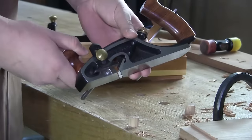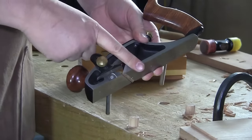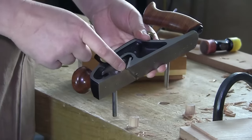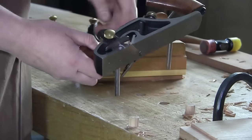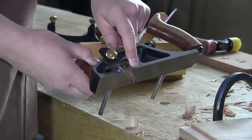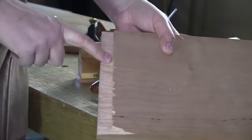In order for the blade to do that, the blade has to be proud of this surface. A 64th of an inch proud doesn't matter — it could be an eighth of an inch, a quarter of an inch proud of this surface, because it is the blade and the extreme point of the blade that is setting the shoulder of the rabbet, or the width of your rabbet.